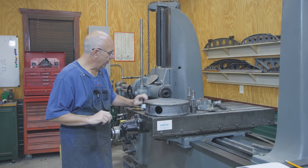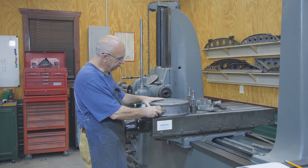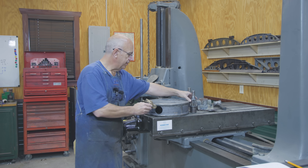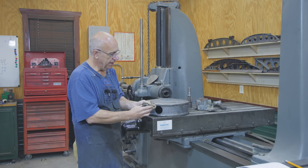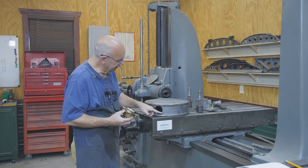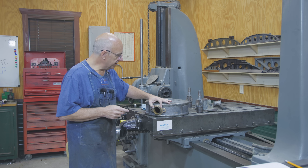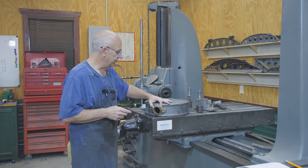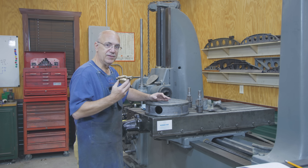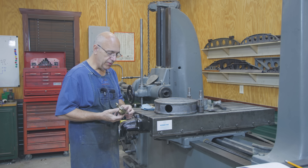There's been a lot of machining that we've had to do to it. We've already gone in and bored these holes in the side, but there are these little bronze pieces that have to kind of bolt up onto the side here. These are here to hold the gears in place and keep them from coming out. The castings need to be notched out to receive this. Unfortunately, we're just going to have to do this the really manual old-fashioned way — get in here with a grinder and grind some cast iron out to get these things to fit.